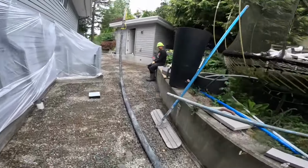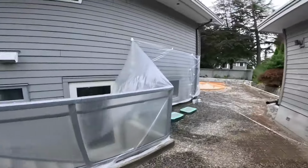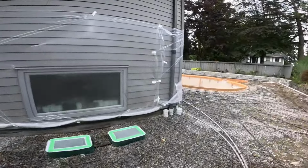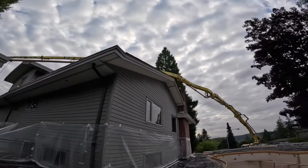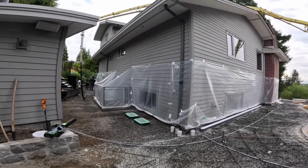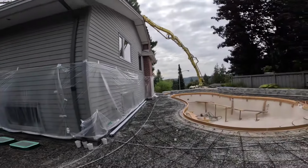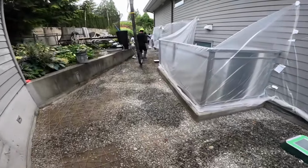Double check our roof line now that our boom is loaded up. Yo! Beautiful. Real slow for the first bit. That small 2-inch hose is very unforgiving in terms of air. Even a little bit of air through that 2-inch line, I'll give it a little, well, a big pop. So we go real slow.